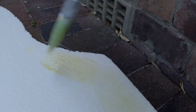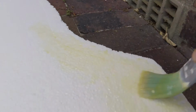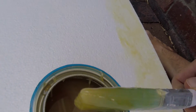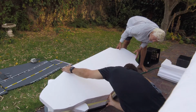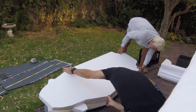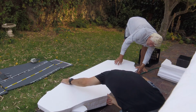But both adhesives need to be left alone for about 15 minutes before bonding, so the glue can have a really tacky texture. These kind of instructions are to be found on the packaging, so be sure to read them very, very carefully. When bonding the surfaces, it is advisable to enlist some help. Heck, I'd say it is essential to enlist some help. Contact adhesives are a one-time fit. They bond very quickly and very unforgivably. The wisdom and zen of the older generation is highly recommended.